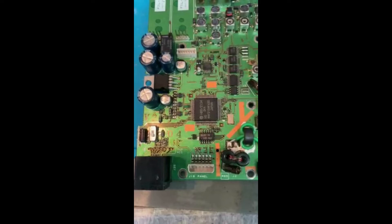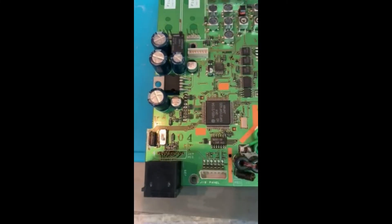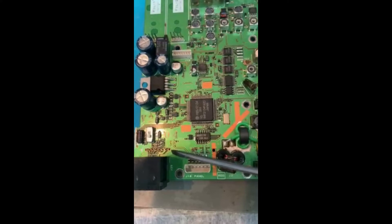You may notice I've been interchanging 897 and 857 freely — they're basically the same radio. The 897 has some differences on the power amplifier board that accommodate the battery setup. The 857 doesn't have any of those battery feature options on the PA board. On the main board between an 857 and an 897, there's only one difference. In the bottom left-hand corner of the board on an 857 you can see the black connector where the microphone plugs in. On the 897 that connector is missing, and the connector just above — you can see the outline for it — is installed and cabled to the front panel.